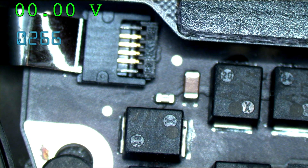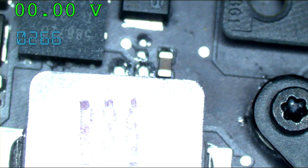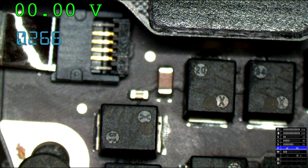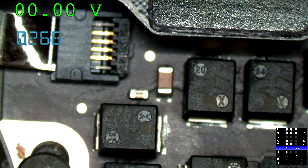We're going to turn on the microscope camera and take a look over here. Now I don't have the short cam, so I'm going to do what I call the Owie test. You're going to put your finger over the caps and then eventually when you go over one of the... Ow! So that's the Owie test. It does look like we have a short circuit on a cap in this area.